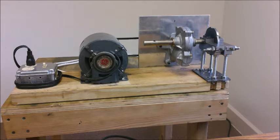This video is going to focus on some initial tests of the chipper or shredder. Sometimes I call it a shredder, sometimes I call it a chipper. You're going to have to bear with me on that. I've got it powered now by a little 1/6 horsepower motor that was in my inventory. First we're going to try it with some 3/16 inch thick, that's about 4.5 millimeter thick, scraps of black ABS that I want to use for some molding experiments with ABS. And then we'll try it with some HDPE that comes from recycled bottles. I've got a shampoo bottle that I cut up that we'll see how that works on. So off we go.